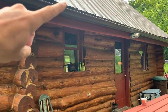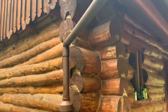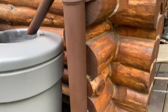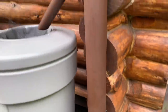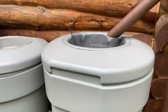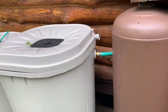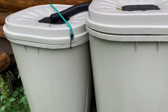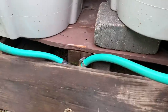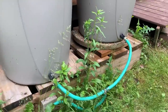Right up here I've got the new gutter system that comes down, connected to PVC pipe. The PVC goes into what they refer to as the first flush — sediment comes in, fills up this PVC pipe where I can drain it whenever I want. Once the overflow comes up, it goes into the first rain barrel, then into these rain barrels — I have them cascading and waterfalling down to each additional barrel. I like these styles because I can take the lids off and clean them.